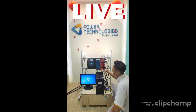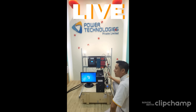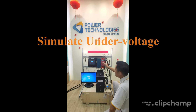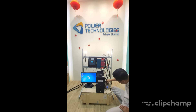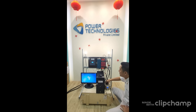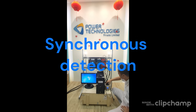Now we will simulate under-voltage to see whether the switch and the controller — the brain itself — is fast enough to react. From 240V, I will bring it down to 110V. When it reaches 210V, it instantaneously transfers to source 2.